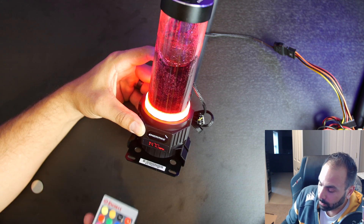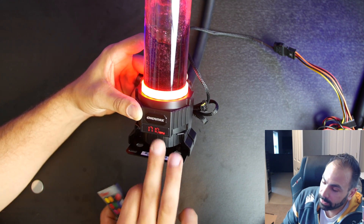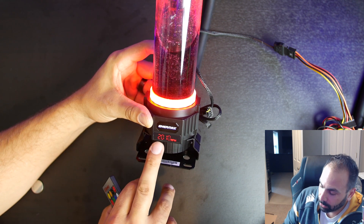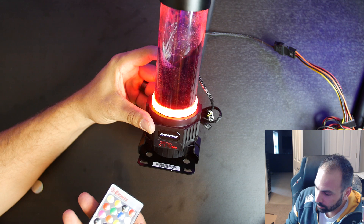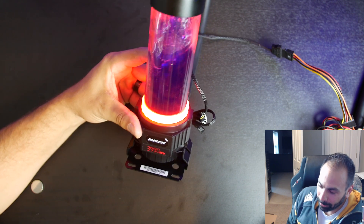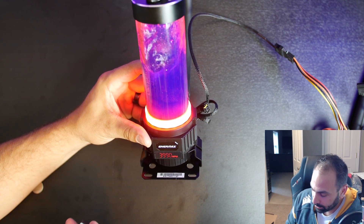We're at 1470 now, and if I hit plus 150 it goes up to 1710. I think it was running at 1500 default and it does vary a little. But you can see it's running at 1710. Let's crank this up — hit the 2000 preset. You can see it goes up right away to 2010. I can actually feel it running faster. This thing goes up to 4000 — that's crazy, it's at 4000. Can you guys hear that? There's a little extra noise coming out of that pump, and you can see the coolant is really swirling around as this motor kicks all the way up to 3990 RPM. So let's back it down to 1500.